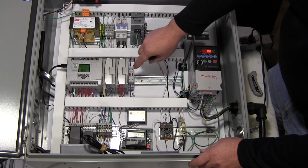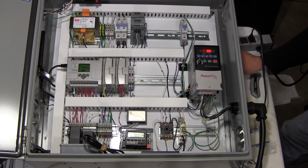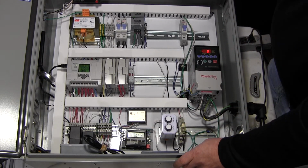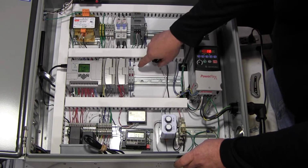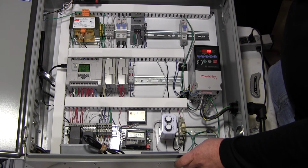Then we've got a couple of override toggle switches here. They'll work with these timer assemblies. I'm missing a part here. Here's a timer. So if we flip one of these toggle switches, 3 of the solenoids will open up, plus the input solenoid valve. And that signal, the blue wires, goes into the input side over here and says, hey pump package, turn on 3 solenoids and run, and give a signal to this to maintain frequency.